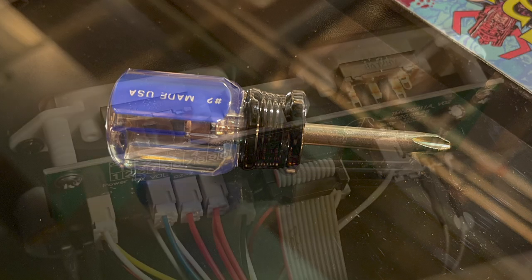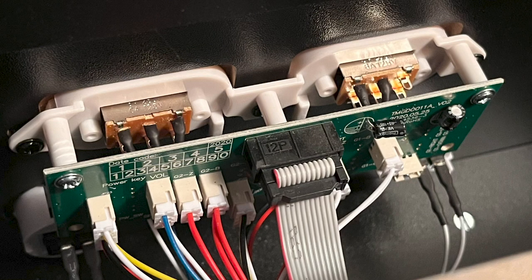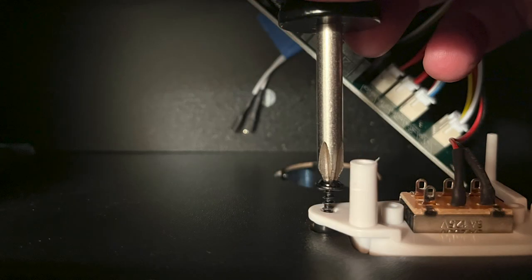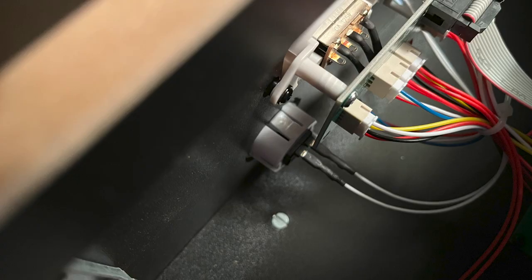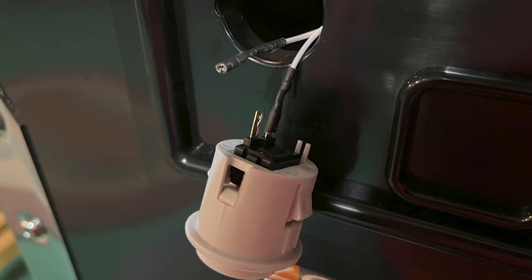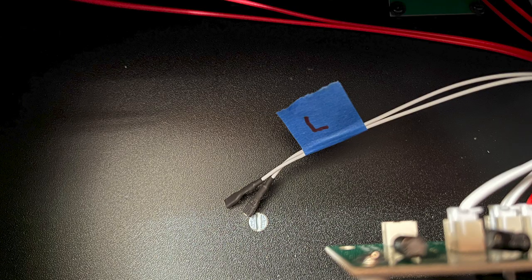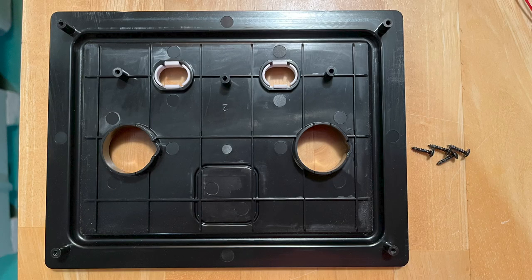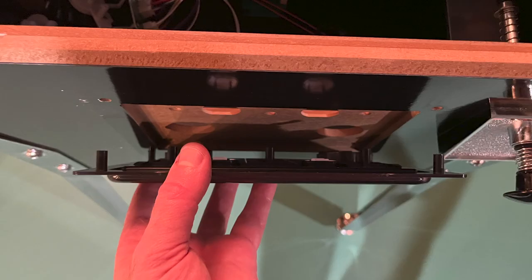To remove the door, I first removed the plug board and the white plastic mount that holds the on-off and volume switches. Both of these are held in place with screws. I then popped out the two white buttons and disconnected them from their harnesses. I labeled the harnesses with tape to make reassembly easy. While I was at it, I removed the flipper buttons as well.